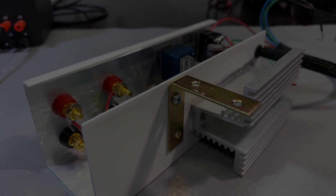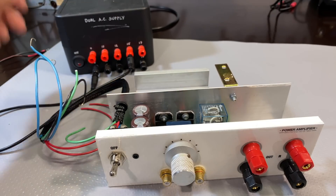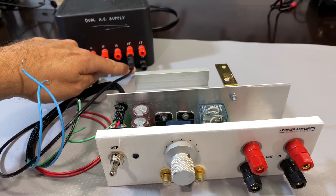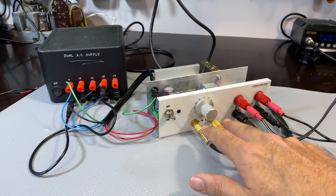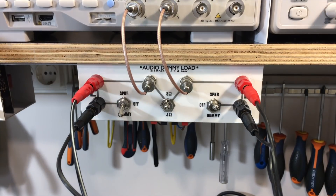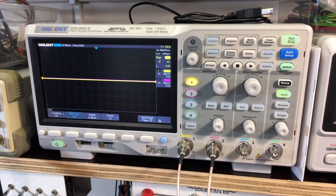All I need to do is set it up to test it. I don't have the actual transformer for this yet, but I do have a dual AC supply - just a transformer with a lot of taps, dual of everything: 0, 10, 12, 15, 17. I'm going to connect this to plus/minus 15, which means I short out the 15 and zero - 15 volts AC and another 15 volt AC with a zero in the middle. I've got a signal coming out of the signal generator into the left and right inputs - the same signal. I've got the speakers connected to the dummy load and the output going to the respective inputs of the scope.